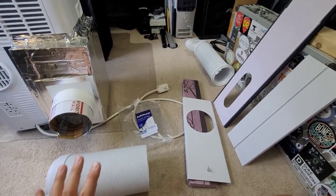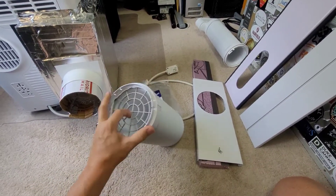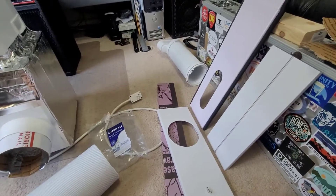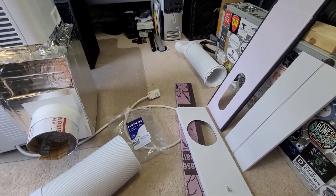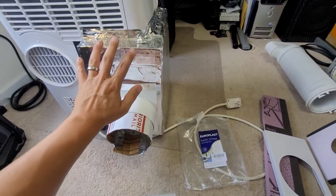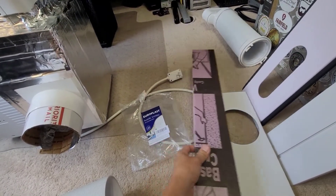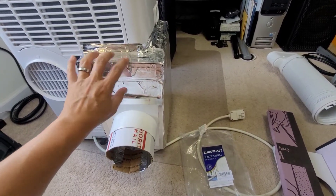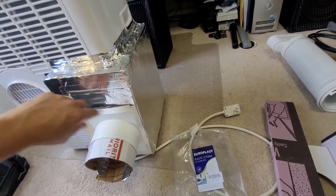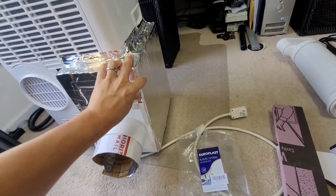I got a kit that included this hose and this coupler adapter — this is going to be an intake. It came with a couple of panels, and a few extensions if you wanted to hook it up to a larger window. My windows are 31 or 32 inches wide, which is standard. I took some closed-cell foam panels left over from a basement project and framed it out so there's a smaller vent on the back and a larger vent for the intake on the side, then covered it and sealed it off with aluminum tape. This is actually quite sturdy. I used a 6-inch flange adapter, which I'll put in the description along with the window adapter kit.